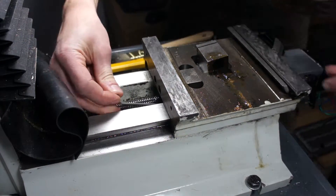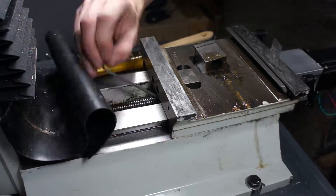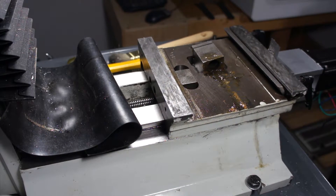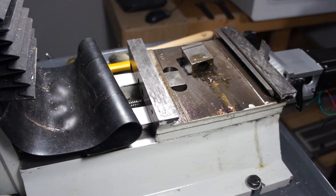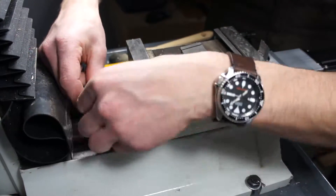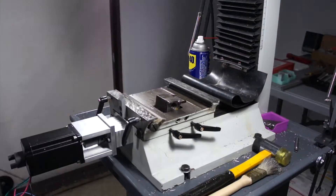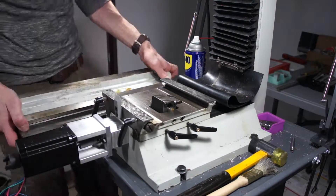Adjusting the same little nuts on the x-axis — or y-axis I should say — for this mill. This is a lot easier done from the bottom of the machine. I just don't want to unbolt it since it's really top heavy and not easy to do with one person. And I want to be able to do it once I have everything set up by just removing the dust cover or chip cover on the back, so I had to see if I could get it from the top.